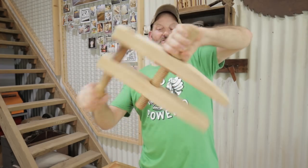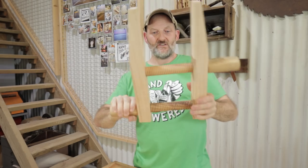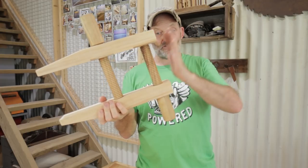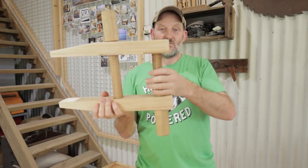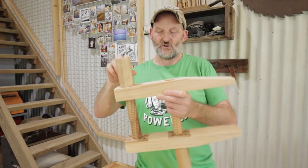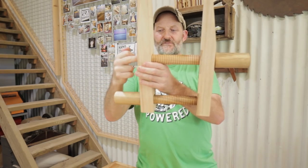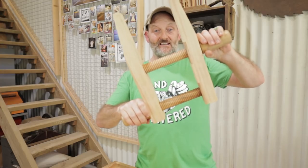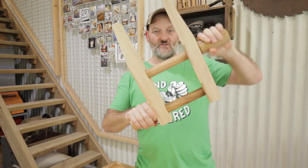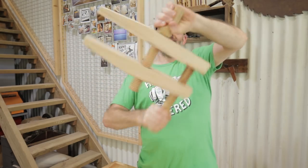You may be wondering how you can adjust it like that when it's got two right-hand threaded screws, because a conventional hand screw clamp would have two opposing threads — one would be a left-hand thread and that's what allows you to adjust it. But both holes are threaded in the same jaw, where normally this screw would be threaded in the opposite jaw. Because they go through the same jaw and are free-running in the opposite jaw, you can adjust it like so. I hope that makes sense, but you can see it works.